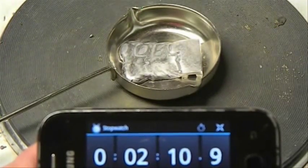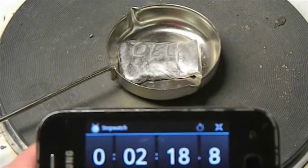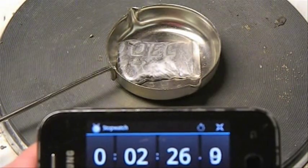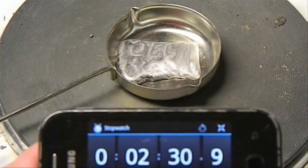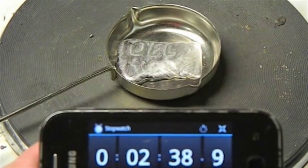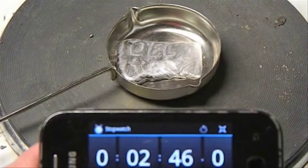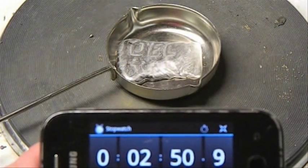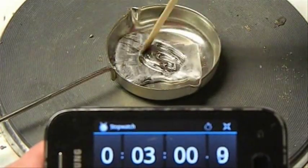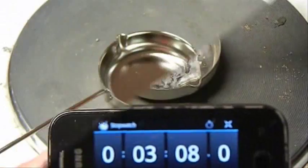This temperature is at least 140 degrees Celsius, but that's not necessarily hot enough for you to pour into a mold. It requires a further heat of at least 300 degrees Celsius before you can start using it in your molds. Make sure that you've stirred up your metal and that it's liquid all the way through and completely runny — not the consistency of thick honey. When stirring, you can see it doesn't leave any marks or grooves behind.